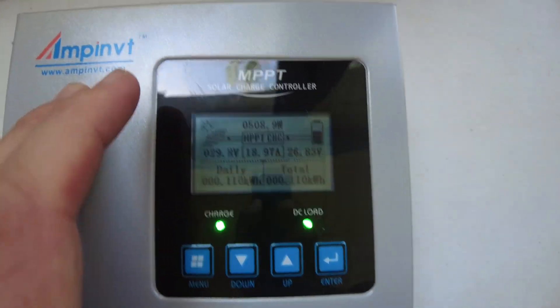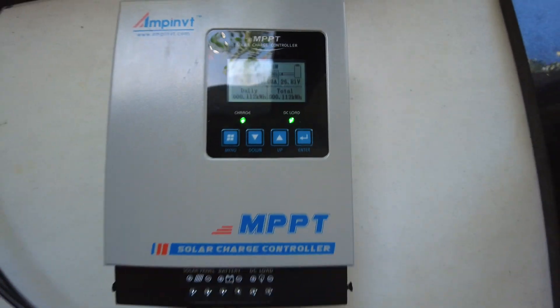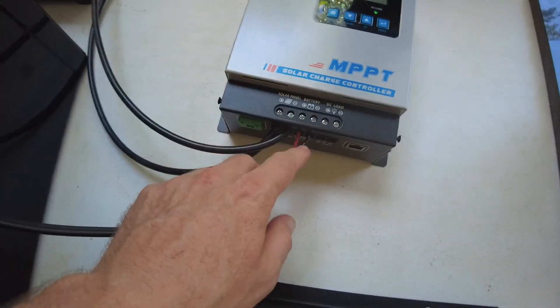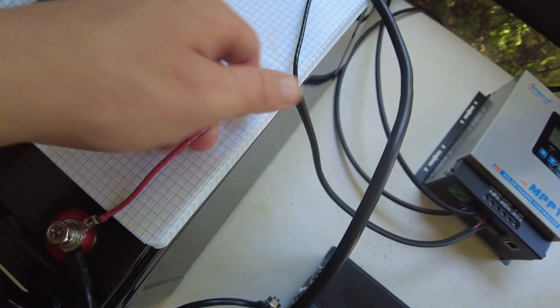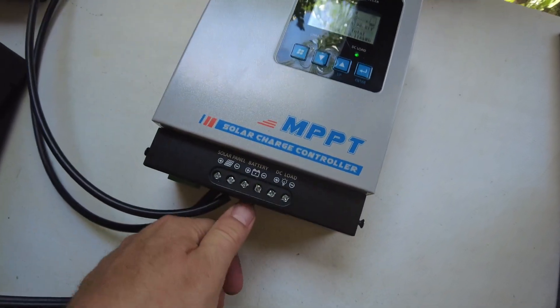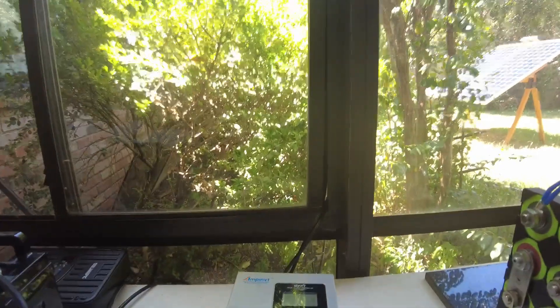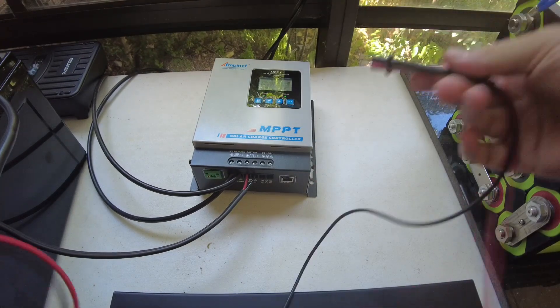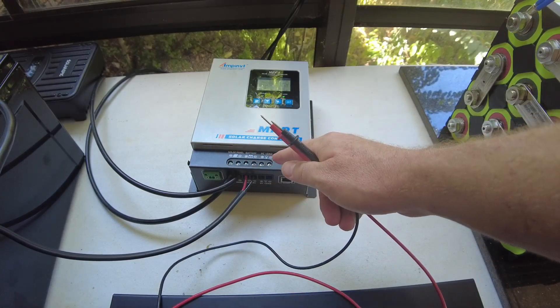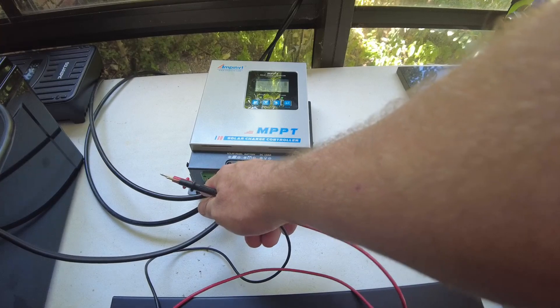So we're pulling 509 watts from the solar. The air coming out of this thing doesn't feel incredibly hot, so that's kind of nice - about 19 amps. Unfortunately I've got just 12 gauge wire going to my battery, so we're kind of topped out on amperage. This will do 20 amps, although it's not hot or anything - it might be a little warm. So we're almost at 20 amps, doing 520 some odd watts. What I want to do now is measure the efficiency of this thing.